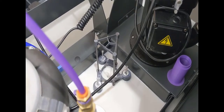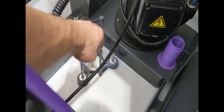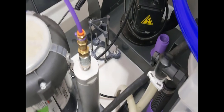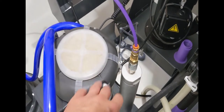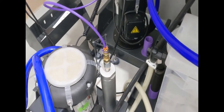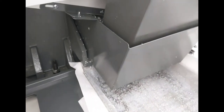It's working quite happily. The rods can be as long as needed since I don't have a top on this section of the coolant tank, but you could cut them down to fit under a lid. I've placed it in the section of the tank where the pumps draw coolant from, so I want that part as clean as possible. Ideally you'd have one skimmer in each section of the tank.